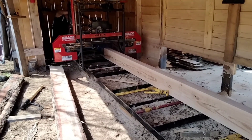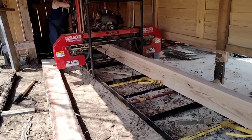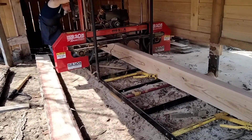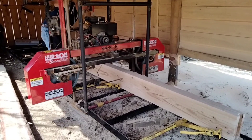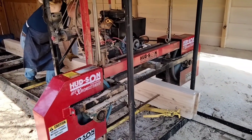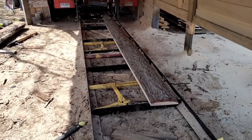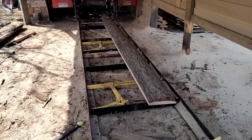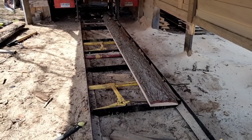The 2x10s that we pulled off of that log, we've now stacked them up standing on the mill, and we are cutting them down to 6 inches wide, which will end up with a 2x4 and a 2x6, as we previously mentioned. The very first piece that we pulled off, we're getting ready to saw that 1-inch thick, and we will end up with a 1x10 out of this piece.